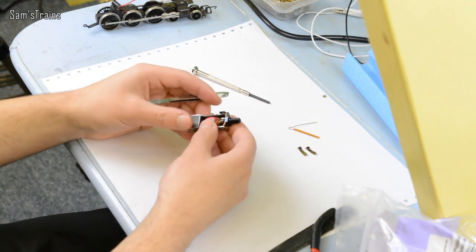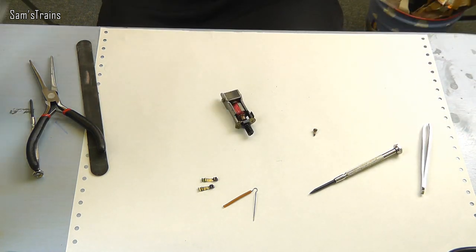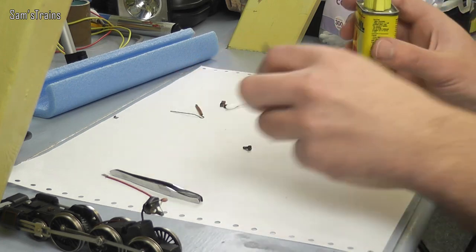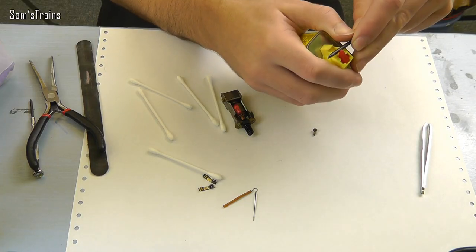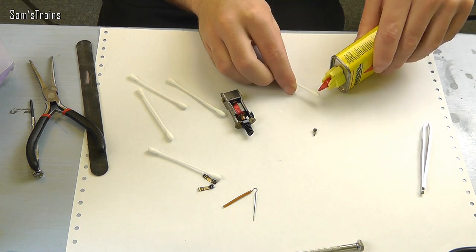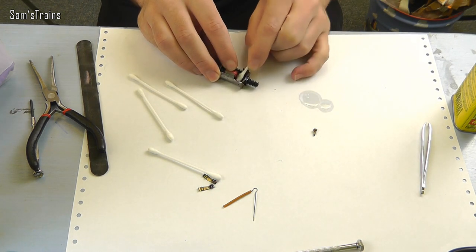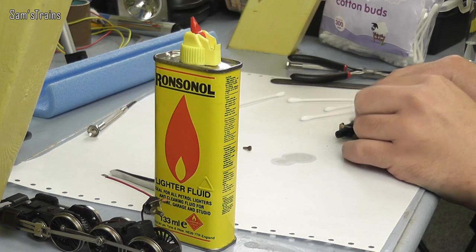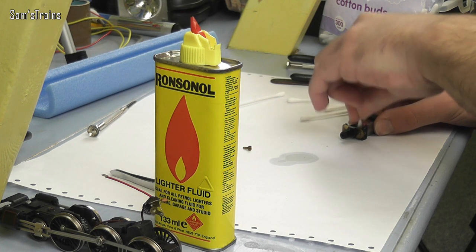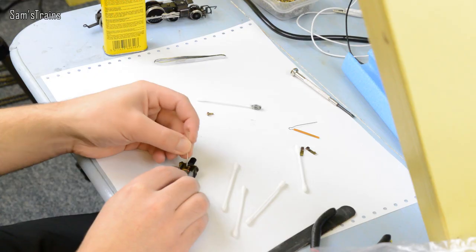Let's clean up the commutator first. I've just spotted a little bit of fluff which I'll get out with the tweezers — there we go. All I'm going to do here is grab my cotton buds — we're going to need a handful — and some lighter fluid. Let's get a little bit of lighter fluid on the cotton bud and clean up that commutator. It's not that bad to be honest; I don't think it would have caused a problem. But if you take it apart you might as well do it. And in between the gaps as well — that's where the mess collects.